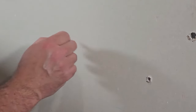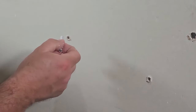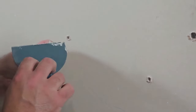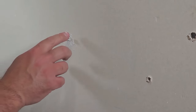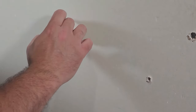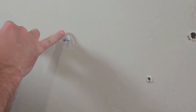No matter what you put in that hole, you're going to have to come back and clean it up. If it's drywall mud, you might have to come back and sand; if it's foam, you're going to have to cut the excess off. But I'll show you how to do it if you choose that route. Get a little bit of spackle or drywall mud, go all the way around, twist that in there, set it, and let it dry. When it dries you can screw it in, but you'll have to clean up the drywall mud on the screw so you can tighten it down. Again, not the easiest or best solution.